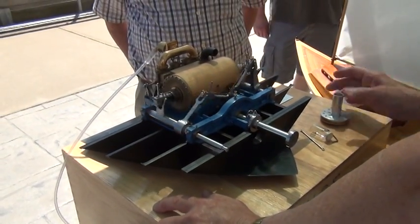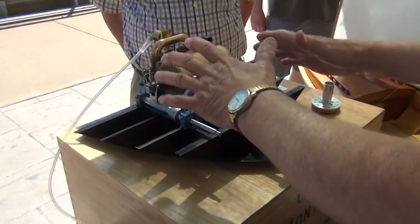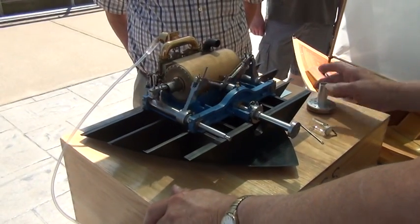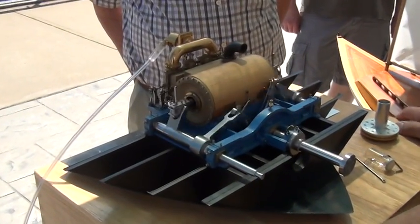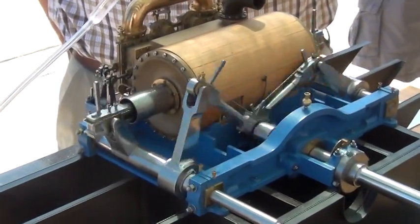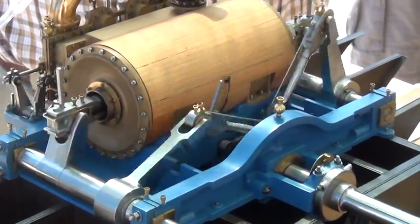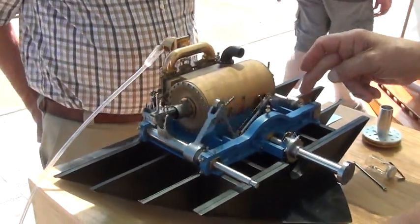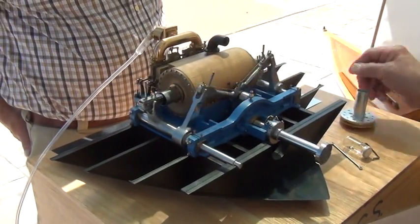Commercial trips? Yes. Well, I have to say that carefully. First of all, this is called a vibrating lever engine because in the 1850s, a vibration was not what we today call a vibration. Anything that moved in an arc, but did not complete a circle, was a vibration. So the old semaphore signals were vibrating your arms when you did it. And because of the arms or the lever shafts moving here, they were called vibrating shafts.